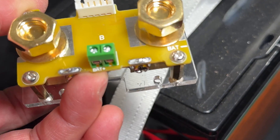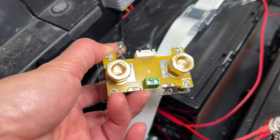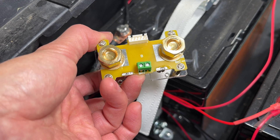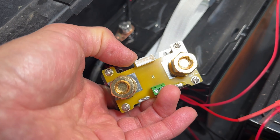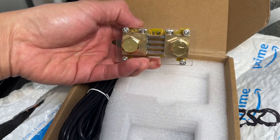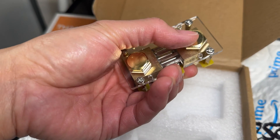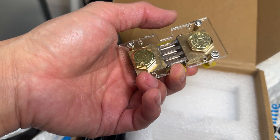In addition, all it needs is a battery positive to this terminal right here on the left to the positive of this guy. And it knows when it's on and when it's off and when it's drawing battery and current. And then you run that plug right here to that screen up front and that's pretty much about it. Last time I had that problem of trying to tighten this thing down with the plexiglass, and once that pressure on the plexiglass was too much, it just ended up snapping.